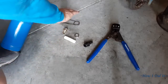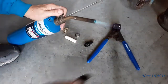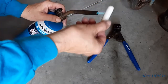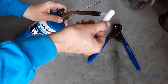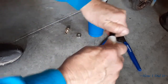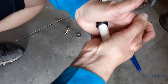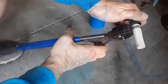I need to first modify how my pump connects from the half-inch PEX pipe to the three-quarter inch PEX pipe. By putting in this pressure tank, it'll ensure that I maintain constant pressure while taking my shower, unlike last night where it cut out. I slightly heated the end of this PEX so it would allow the adapter going into the pump to connect — it was just a little too big, but that little bit of heat and it worked perfectly.